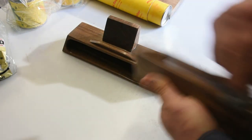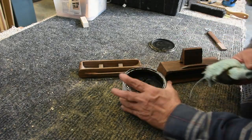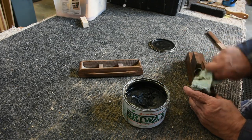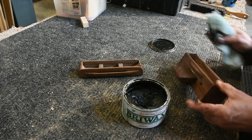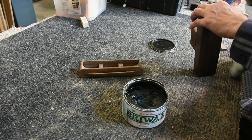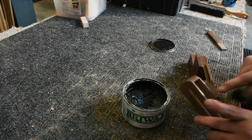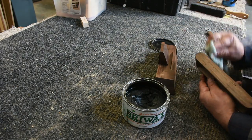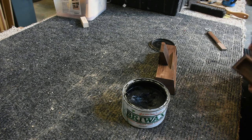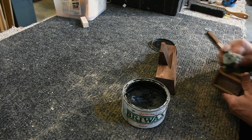I continue along the front as well. Then I wax it — I've used Briwax for years. This can is probably five years old and we use a lot of it, but you only need about a thimble full for a small project. I coat everything and let it sit for about half an hour to evaporate a bit — it goes into all the pores and gives a really nice smooth finish like fine furniture. I coat the entire drawer too; I never sprayed the outside of the drawer but I coat it with wax so it'll glide in and out of the cavity smoothly.